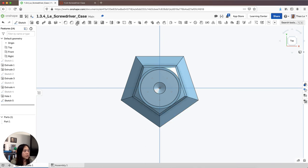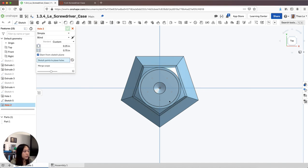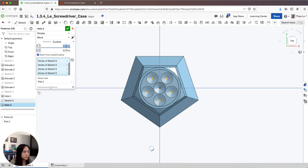I have five points and I'm going to make holes on these points. I'll create another hole — also a simple hole. I'll select all five points and change the diameter to 0.125. Depth will be 0.35, going all the way through. I'll accept my holes.